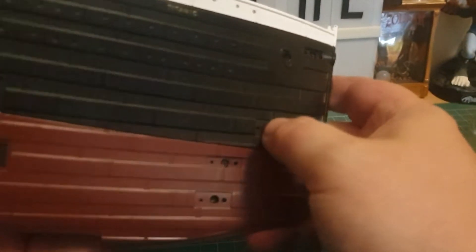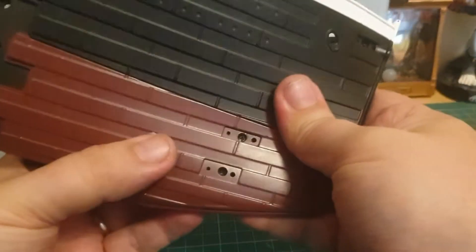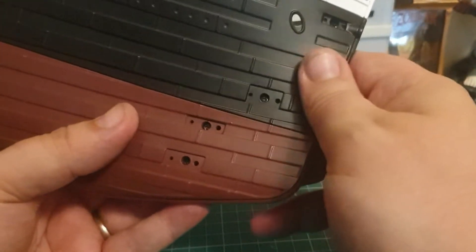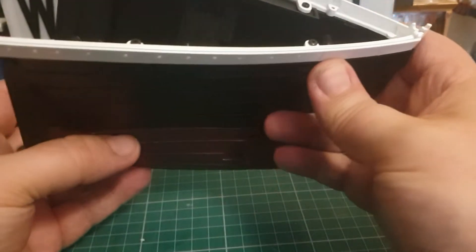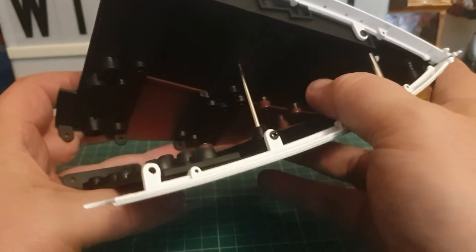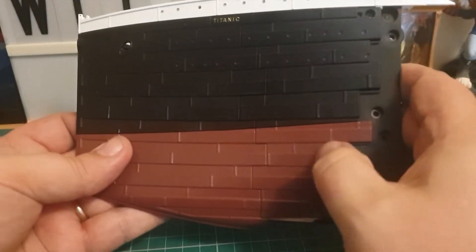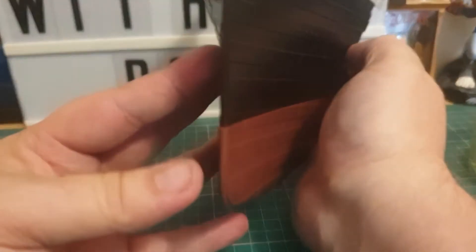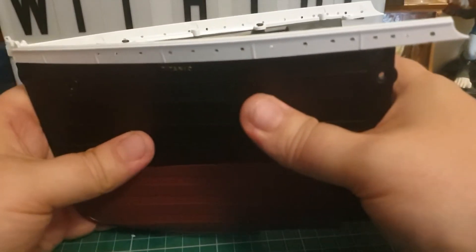I had a little difficulty with the screws — what was happening was they weren't biting. The reason is that these spacers inside, if they're just out by a little bit, it's not going to tighten up. You have to hold this thing really tight as you screw these in, then go back over them to see if they'll go a little more. I got a few more turns on each to really tighten it up and it is solid now. Make sure your spacers are down as far as they'll go. The very visible join line on this side is starting to fade quite significantly — and that's going to happen more as the tension builds. From the front the join is looking very good, and we've got this nice solid piece of boat.